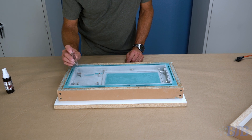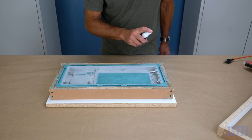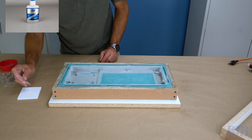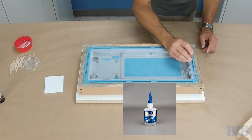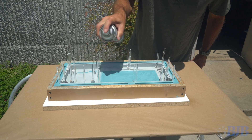My plan is to leave enough of an indentation so I can drill the blind holes after the part has been cast. I now determine where I want my high and low corners to be. When casting, I will locate the sprues somewhere near the low corner, preferably to a thick wall section, and apply vents to the high points of the pattern when angled. I will then spray our Zip Release over the rest of the mold.